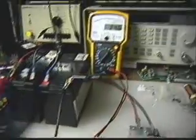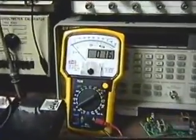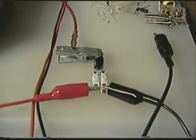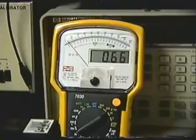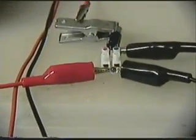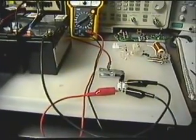The inventor says that it loves voltage, so I've taken two lead acid batteries, put them in series, and we have 24.6 volts. I'll connect the meter across the capacitor and give it another shot. We're in the same situation as before — the voltage measured across the capacitor is declining. I'll hook up the negative lead and see what happens with 24.6 volts. We're seeing a slight charge again as before, then it reached its peak and is now declining, and we have nothing coming out of that LED — not even the faintest amount of glow. So obviously I'm doing something wrong. I'm going to have to go back to the forum and see if I misinterpreted these schematics.